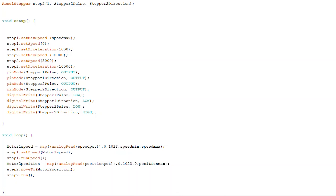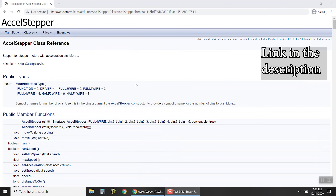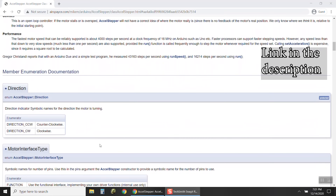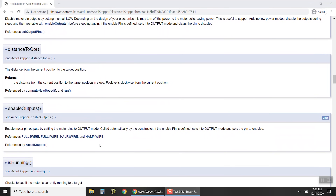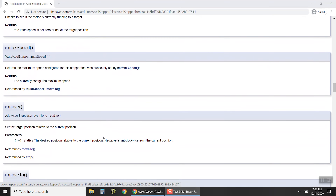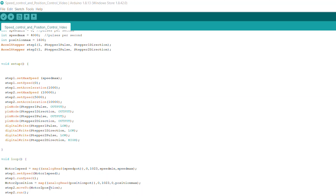Let's take a quick look at the website where you can see all of the inputs that you can get from the AccelStepper library. This shows you everything that the AccelStepper library can do - all the parameters, how to set them up. Even if you don't understand exactly what something does, basically what I did as an experiment is put it in my code and see what it does. You'll quickly figure out how to use them to write your code. This part of the code will run over and over again very rapidly, so each time I change the position of the potentiometer, all of this happens over and over again - it's going to recheck the potentiometer, change the speed, start running the motor. If you've never used the AccelStepper library before, you will need to install it first.